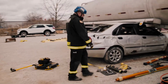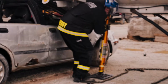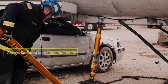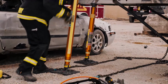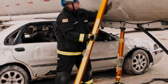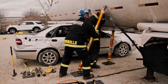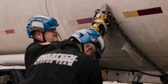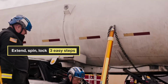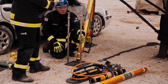Okay, first thing, I'm going to come in on the tank. I'll put the Longshore nearly vertical to stop the crush on the big vehicle over the small one. Then I'll come in with the stabilization of the big vehicle. I'm going to bring in the chain. Take the slack out of the chain. We're going to stake the base. Stake should be driven in 2/3 of the way for demo purposes. I'm just going to take them in about 6 to 8 inches.